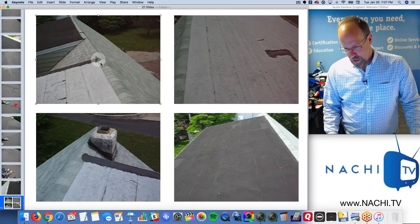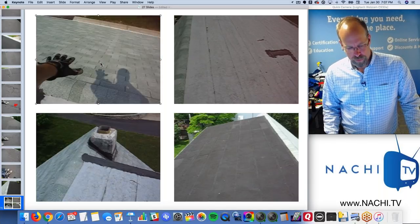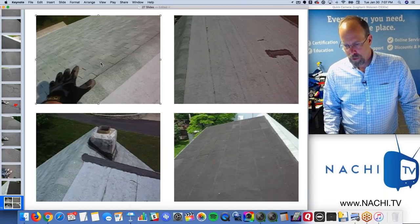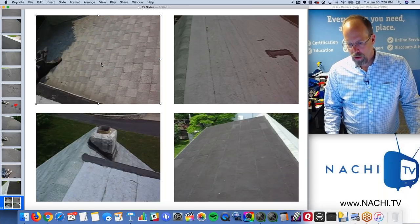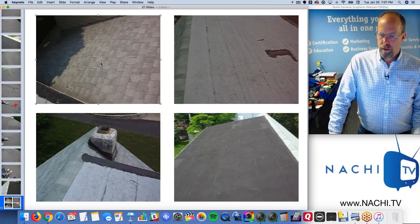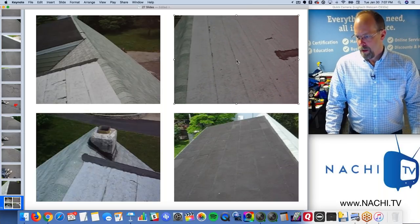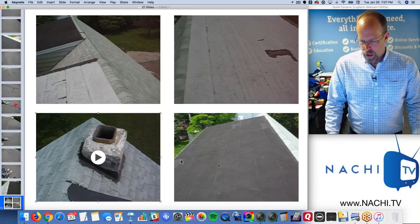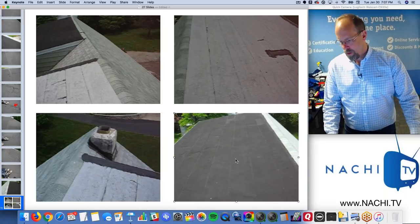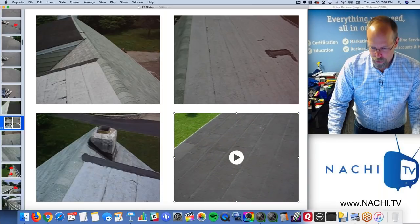It's quite easy. There are two different shingles on the roof. The front green shingle appears to be a newer shingle and in good shape, young roof. The gray shingles on the back seem to be older, but still in good shape. Yeah, that's me. On the left side, there's a flat. Yep. And then there's the chimney, the chimney stack on the left side. And then there's the flat roof. The roll roofing material on the right side of the house is in poor condition. Okay. So video. Consider video.